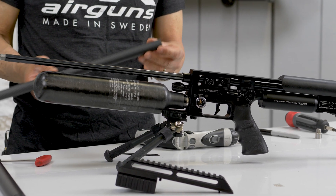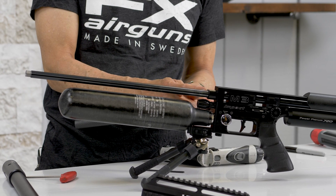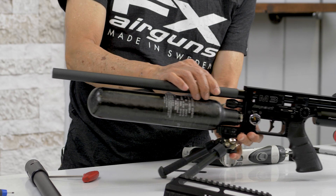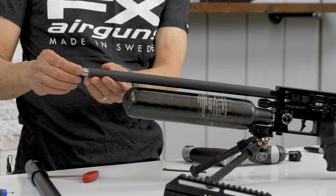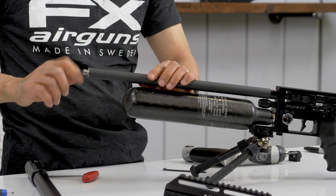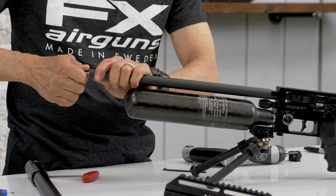It's a carbon fiber sleeve that slides in on its clamp. There's a little lip here of about one mil — it has to go like that. Then your jam nut — you want to hand-tighten this and mark it, then turn the jam nut a quarter turn.